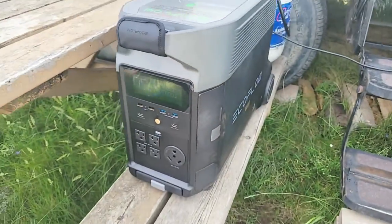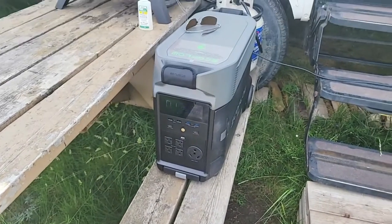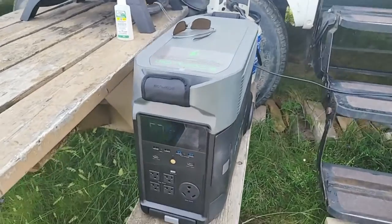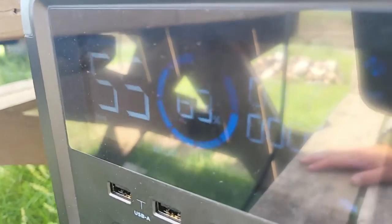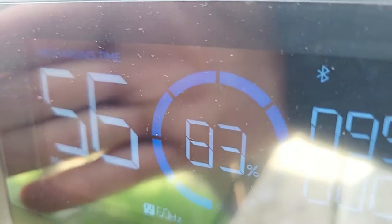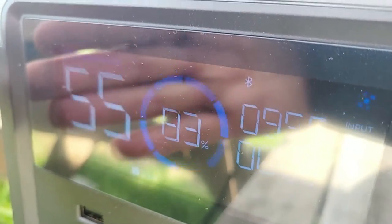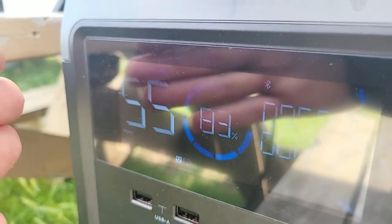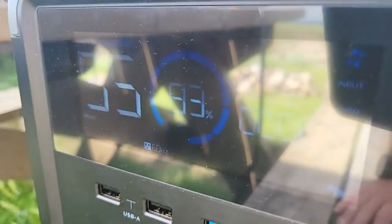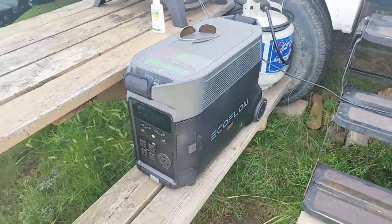So we're now connecting the 1200-watt array. I'll climb up there with the camera and show you how that looks in a moment. Okay, so we're just going to wait for this to creep up. Our 1200-watt array — there we go — really, really good readings for a 1200-watt array on the top of a trailer, which is absorbing a lot of heat. And that's what we're going to talk about: how heat affects solar. So let's call that 960 watts versus 900. There's a 60-watt difference.